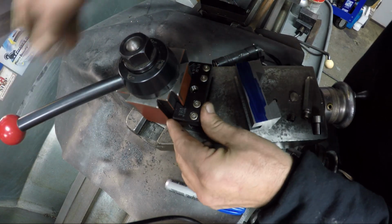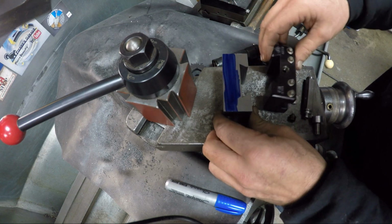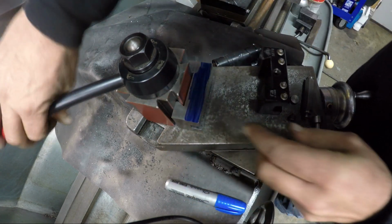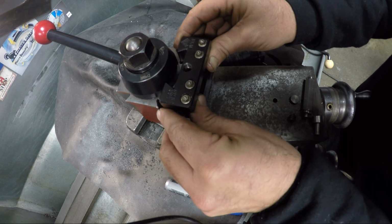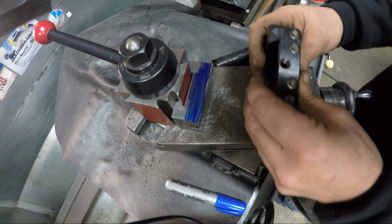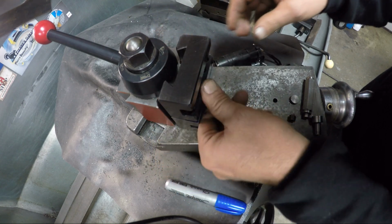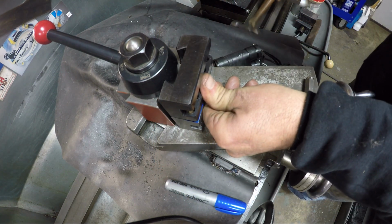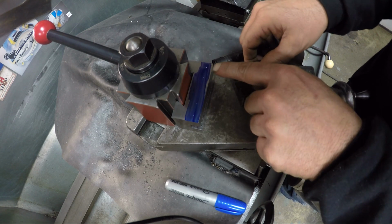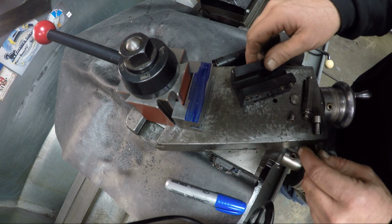I actually need to take this off because this dovetail's tighter, so once this is locked on I can't get this one. Can't get that one off, so I can lock that one, and this one will slide on. So I kind of like that being a little tighter. My handle doesn't come near as far around, but I set it down on there. I push it back against the tool post. A couple little baby taps, and that's good enough for putting my center finder on them.